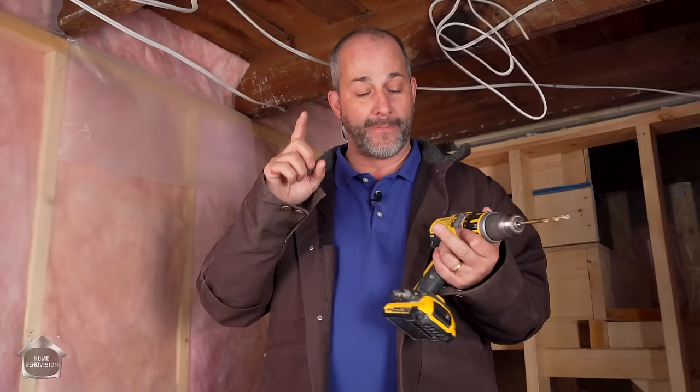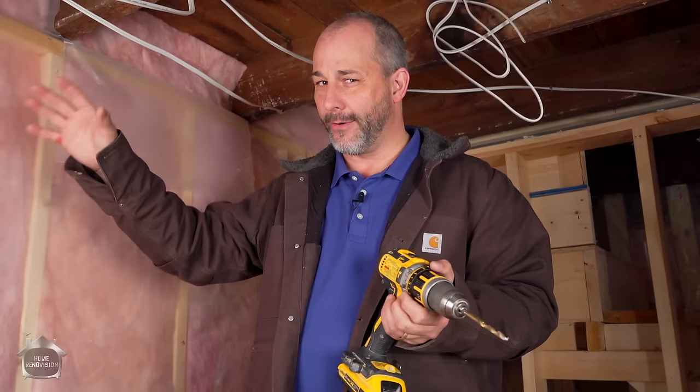The second thing you're going to need is a cavity to put your fan in. In most bathroom ceilings you've got a lot of options. One of the things you want to keep in mind is where do you want the exhaust to go — you don't want it near a window — and where do you want your fan to go. Ideally it's in about the middle of the room in the highest location of the ceiling. As long as you've got your studs with a decent span, usually 16 inches, most fans are 8, 10, or maybe even 12 inches wide, so you've got lots of options.